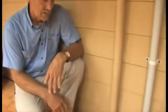Alright, the first fitting we're going to look at outside the house is this thing here, which is called a vent. It's plumbed into the main drainage line and it flows up the wall here through the veranda and goes onto the roof space. At the top there's a vent and it's exposed to the air. It's always a good thing to look for first because it's always between the first and the second fitting, so it gives you an idea where the head of the drainage is or the start of the drainage line.